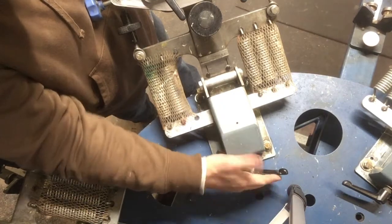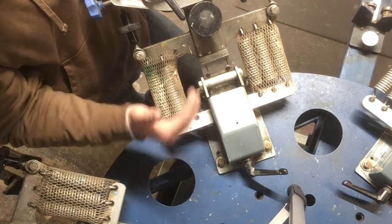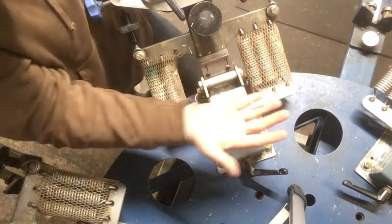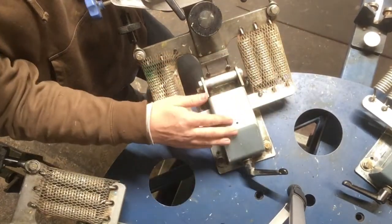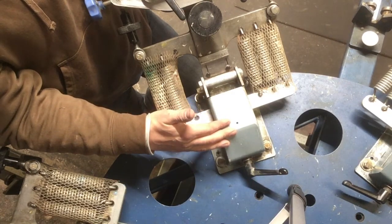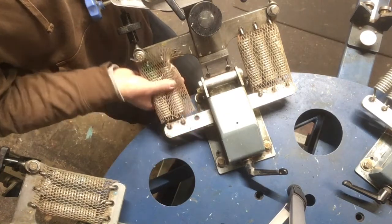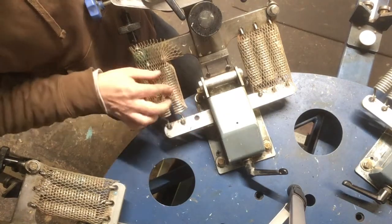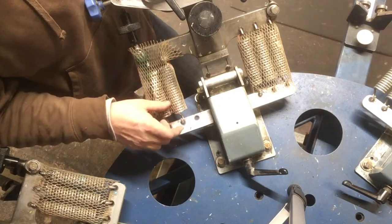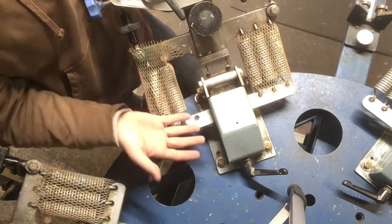So on the Chameleon you have this kip knob back here, which is the tension for these springs. So the first step is to release that tension. Now, a bit of a trick that I learned was to put something under here, some kind of padding. That way when you release the tension, your others aren't falling out, because that's the trick to it, is that when you release the tension, they all become loose and want to fall out of there.